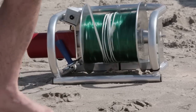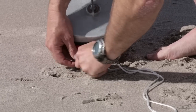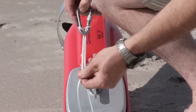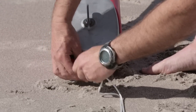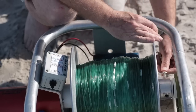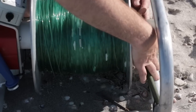The first thing to do is to loop the strop through the carabiner. This is done by removing the carabiner from the seahorse and then looping the strop through the centre of the carabiner and over the top. The strop will then pull tight into a half hitch on the carabiner. Reconnect the carabiner to the tow point. Also, remove the D-pin from the winch and clip onto the winch frame and drop the drag rubber onto the drum.